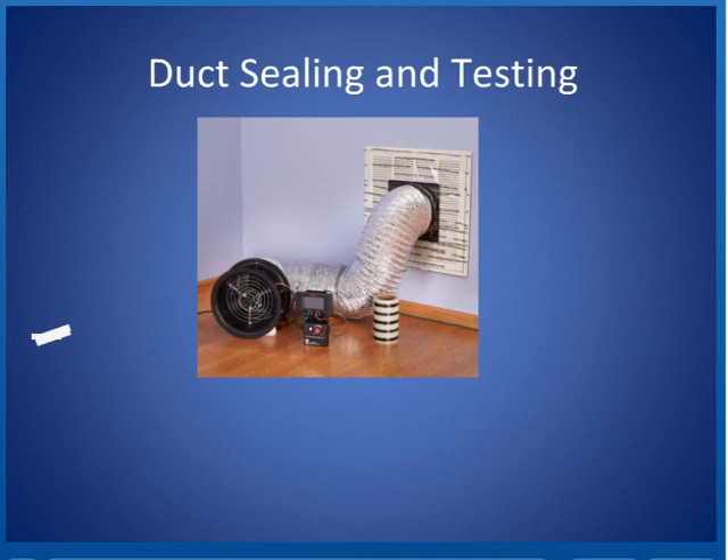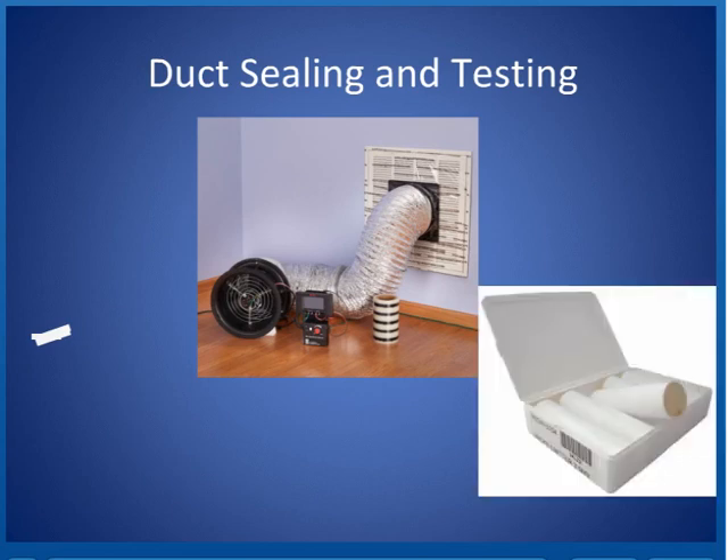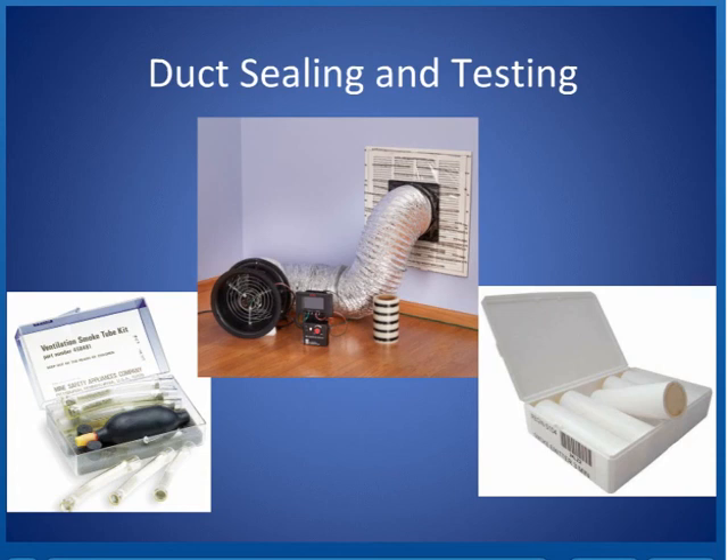To do that, you need to seal up all the registers and grills, and then you take a calibrated fan like this and measure the airflow. Then you can look for leaks. One way to look for leaks is to use a smoke test — you put smoke into the calibrated fan and smoke the whole duct system. If you have big enough leaks, you'll smoke the whole house and set off the fire alarm. What I generally do is use a little squeeze bulb with chemical smoke tubes. I break — bend — the tube, go around with the squeeze bulb, and smoke comes out wherever I need it, so I can see which way the air is going and mark where holes and leaks are when they're small enough.